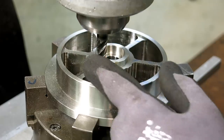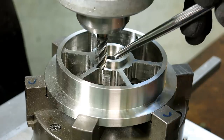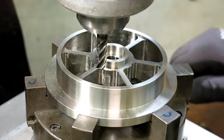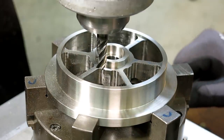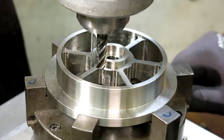My experience with this Niagara stabilizer so far is, this thing's pretty badass. I'm going to take this whole thing here, all the ridges and everything in one crack. This tool seems to behave itself better when it's fully loaded, which is kind of amazing. So I've reset the pins so that I get this rotation now. And once again, I'm conventional milling as opposed to climb milling, because I was a little nervous hand feeding climb milling.